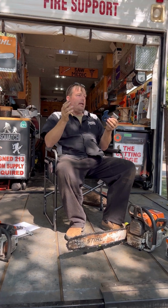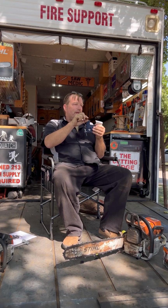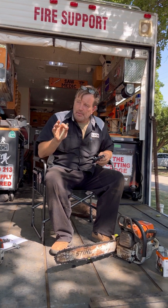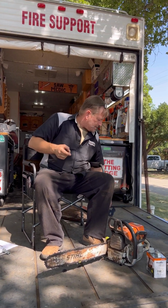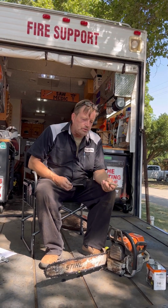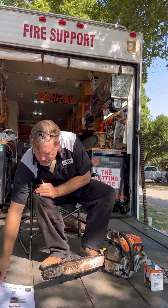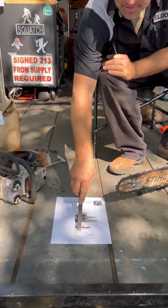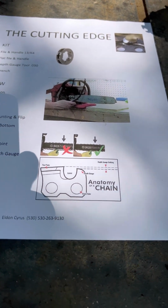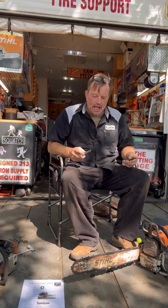And that depends on what you're cutting. Cutting big trees, you want it nice and smooth. If you're just limbing, bumping knots at the landing, you want a bigger gap, because the saw will do that. Is that part making sense? So now I'm going to tell you about my way of using this tool to set that gap. And there's a picture trying to show you what we're talking about. The gap is the height of this cutting edge towards the front of that bump. Does that make sense? So the way that we're going to do that is with a gauge.